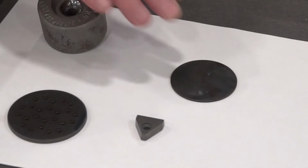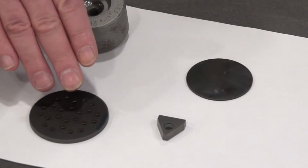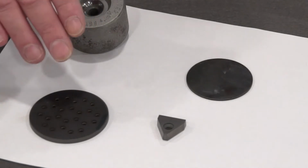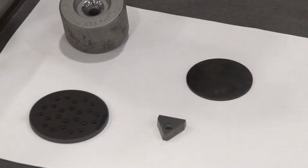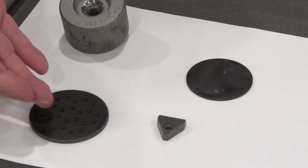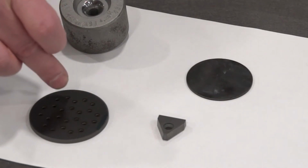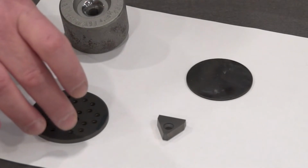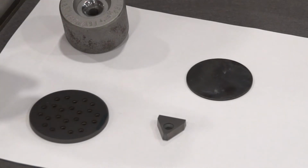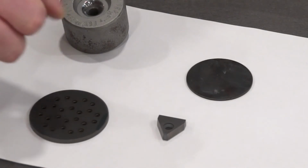Moving alongside that, this material here is what we call CBN, and we also have PCD, polycrystalline diamond. This is incredibly difficult to machine, not just because of the toughness, but because of the conductivity of the part. So we have a special generator, and in the disc we will place the screw holes, which would invariably be for the indexable tip, and then afterwards it would go to one of our high voltage generator wire machines to have the indexable tip wired out.